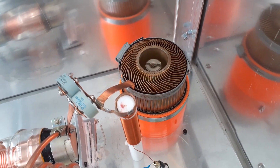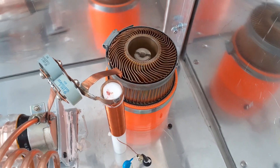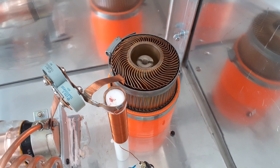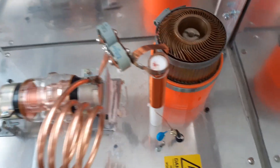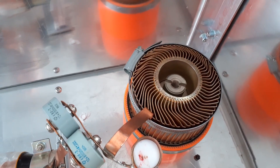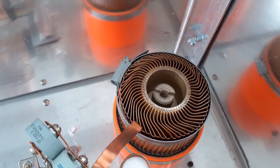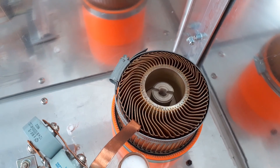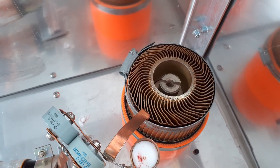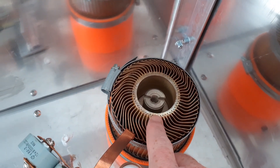This thing will run at 1500 watts, but it's not rated for that. The toroidal transformer is only rated for 1500 watts peak, or 750 watts continuous. The legal limit in the UK is 400 watts. There's a blower at the back — it's about half the size recommended for this triode, but I'm not running it anywhere near full capacity. At 300 to 400 watts, even on data modes, it should be okay without any issues.